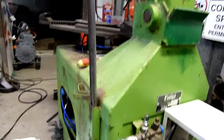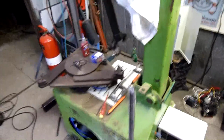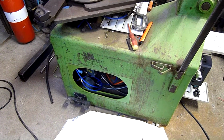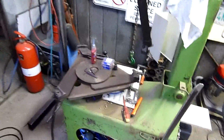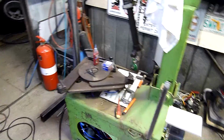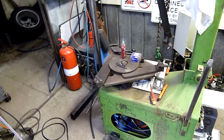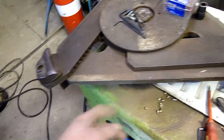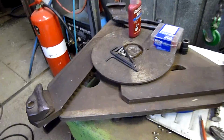Ready for a paint. Actually, I'd like to get a can of Kermit Green and give this thing a proper paint again. Especially around here, there's a lot of rust. Just give it a good rub back with maroon Scotch-Brite, the dark red one, and just rip back all the rust and everything with the coarse Scotch-Brite, and then give it a blow over with a bit of green and white for the side cover, top head assembly. I don't know if the table was ever painted. It does show signs of white paint, so I think the table was painted. That's about it. We'll just mask off the decals on the front, and that's all. And mask everything off, of course. Yeah, beautiful.